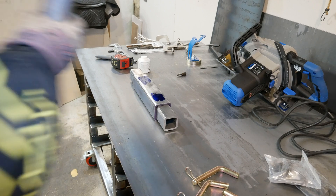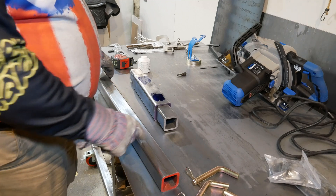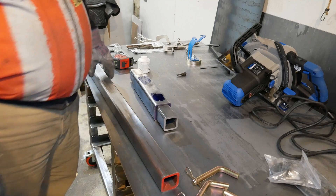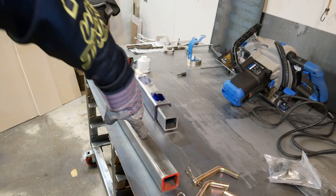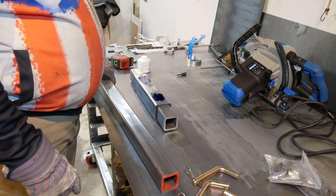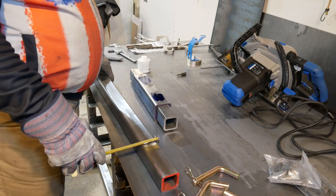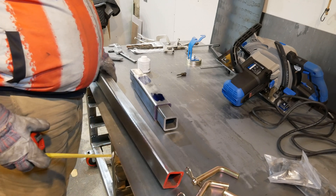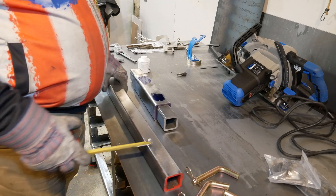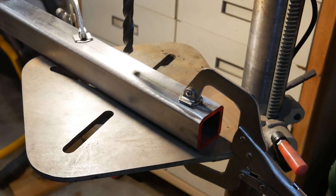This is where the hole needs to be drilled through — right there. That's where the nail punch went through, and now we'll see if it's in the center. Yep, directly in the center. Look at that — the center punch worked. Let's get some oil on this guy.